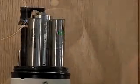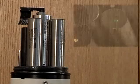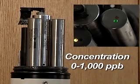The rhodamine fluoresces red light in return, which is detected by the sensor. The amount of red light detected is proportional to the amount of rhodamine in the sample and can be reported as a scaled voltage from 0 to 5 volts or as a concentration from 0 to 1,000 parts per billion.